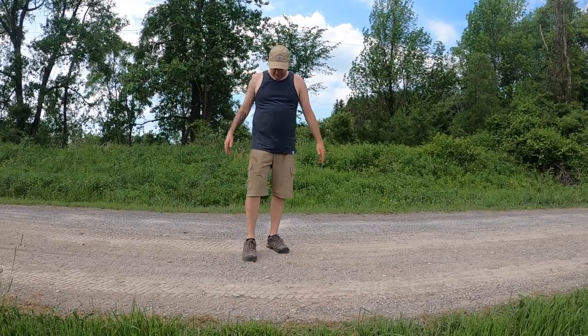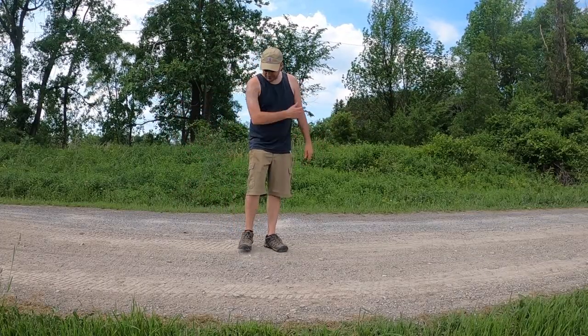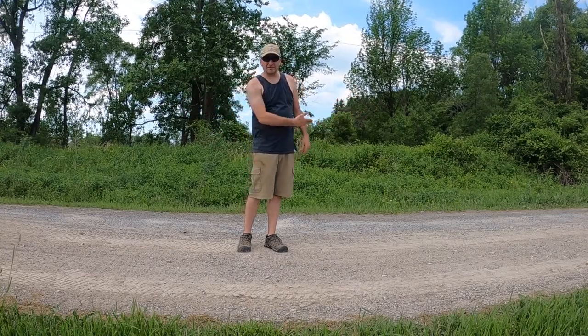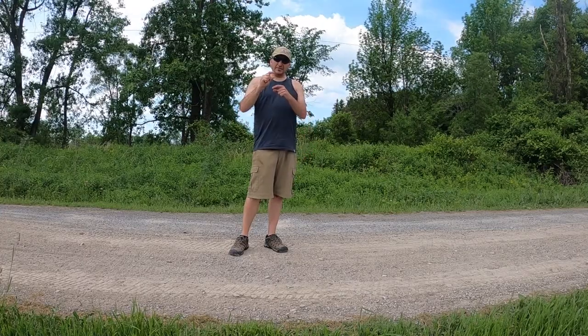All right, so as you can see, that pothole is gone. I dug it all the way out. I went by a couple times this direction, a couple times this direction, and then I used the blade and pushed it backwards, and it ends up leaving about an inch layer, and that's because the frame sits up about an inch higher than the blade in the bottom.